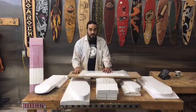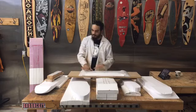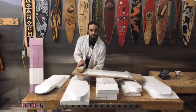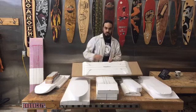And this is where you would grab some wood blocks and you would clamp outside of the bag. You would do the whole lamination like normal, get this in the bag. But once it's there, you would clamp it to the top and bottom so that you can force that veneer down into that square drop. Once finished, you've got something that looks similar to this. You'll always go, when you're doing a custom build, with a square design.